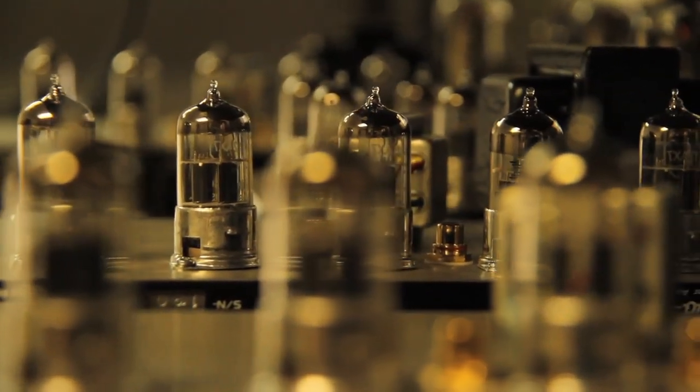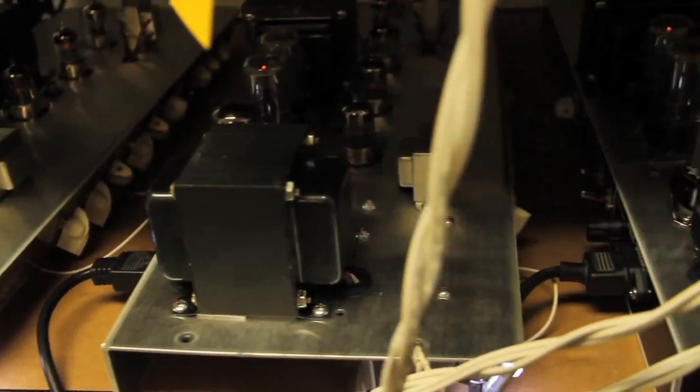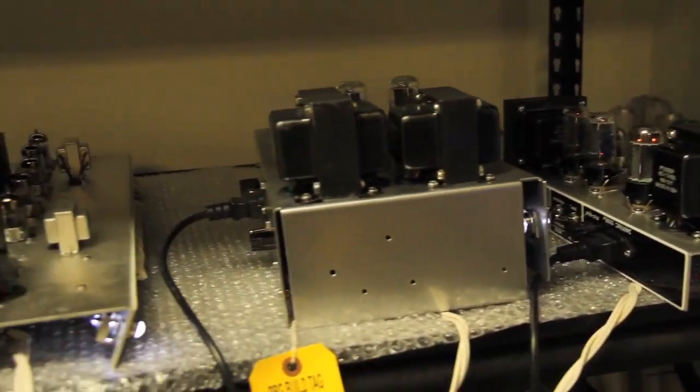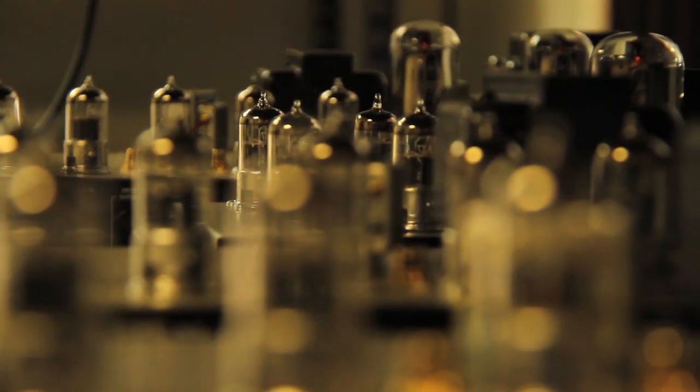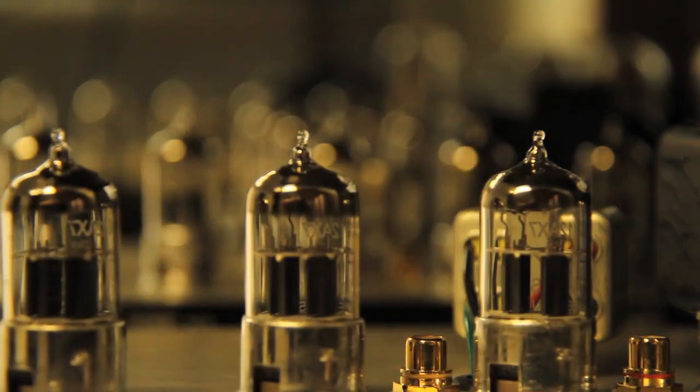Nice. Here we are in the cook room, cooking the amps after they come off the final build. The Tone King amps go through a sequence, a sort of an on-off sequence while it cooks the tubes. So this will go through about a 10-12 hour process here, and it'll cook overnight and basically just burn in the tubes. Awesome. All set to go. We do a similar process with all the Two Rock stuff.